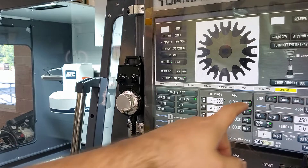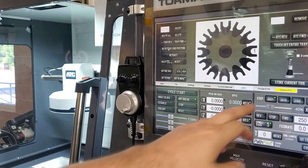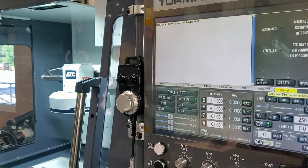You can see on the right here under status that it has turned yellow. If we look at that now, you can see the alarm that came up: ATC device, tray sensor not detecting arrival. I do want to mention that we have changed the wording of this alarm a few times over the course of various updates to PathPilot, so the exact wording may differ depending on which version you're on, but the gist is the same for all wordings.